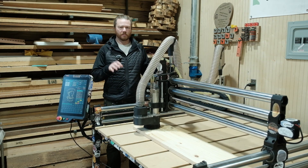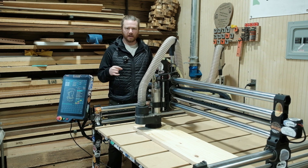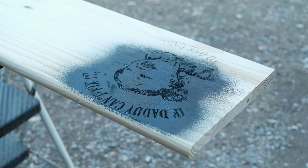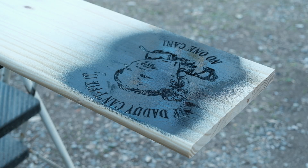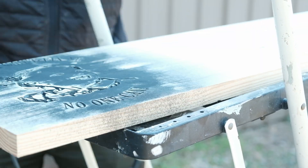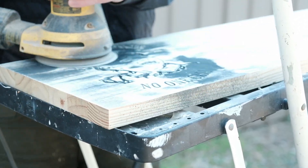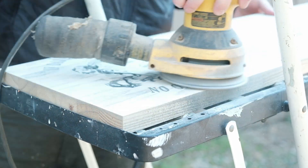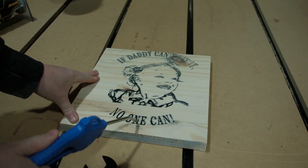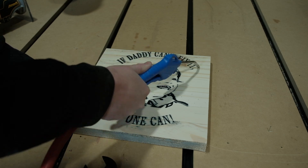The new file is in and you can already tell a tremendous difference — it's just moving to the next space and starting to cut immediately. A very simple thing like that for brand new beginners can be killing your day because you start thinking, why is this thing taking two hours? It could be something as simple as making sure your Z safety height is set correctly. For mine, I normally set them at 0.1 or 0.05, especially when I use double-sided tape and don't have any clamps running around. If you do have clamps, you might want to set your Z height higher, but that does add a lot of time to your carving.